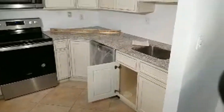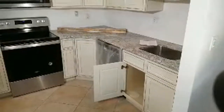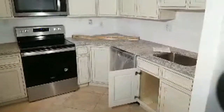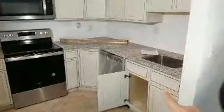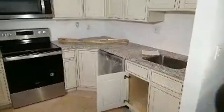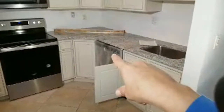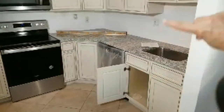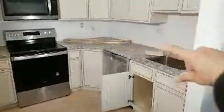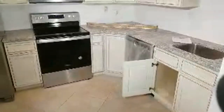So there you have it, folks. Hopefully I gave you some pretty good informational tips, things to do and things not to do when you're having work done in your kitchen. Even if you're not doing the work, if you're having somebody come in to do it, at least make sure they're doing it right. And if they say, oh, relax, I've been doing it this way for years, it's not okay. Because if you pull out the installation guide for the dishwasher when it comes in new, it'll say it in there. It'll say it's got to be something like 32 or 34 inches above the floor before it comes down to the garbage disposal.